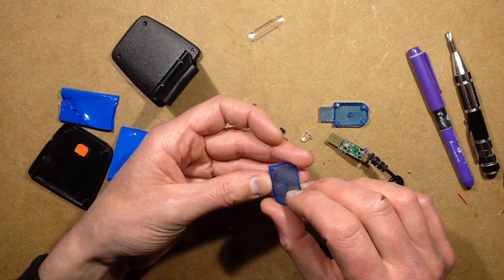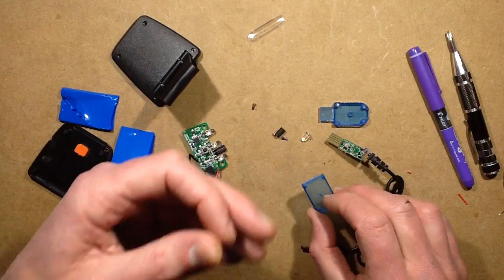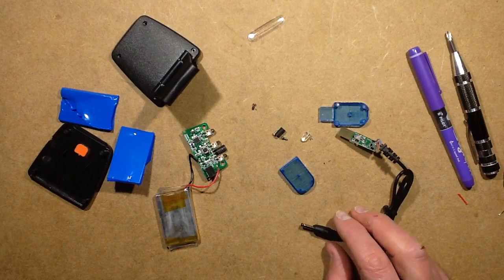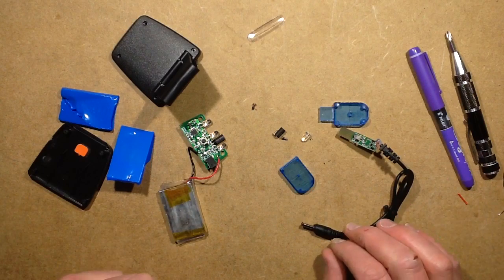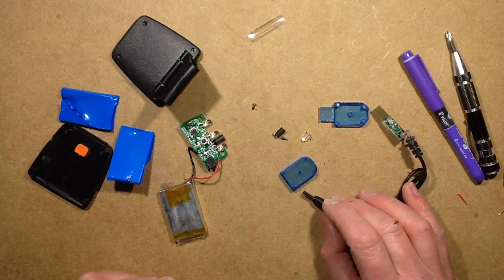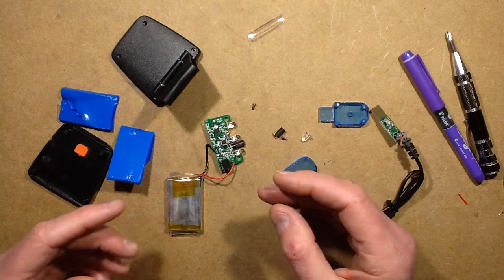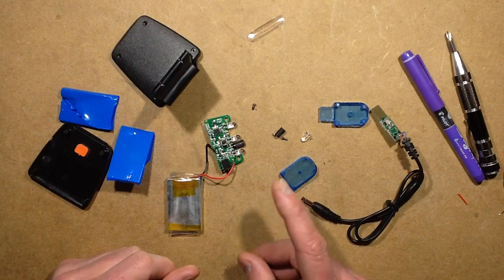The charge protection is on this little circuit board. Reading the embossed text: it says 5 volts in — obviously because it's USB — and 4.2 volts, 500mA. It certainly does put out bang on 4.2 volts, well 4.21 but that's close enough. The current I found it was charging the cell at was typically around 200mA, which is fine. It's not the 500mA it says on it, but slower charging is better. The running current is 59mA, so roughly 20mA per LED — the LEDs are not being pushed too hard.